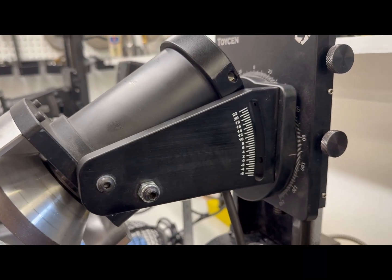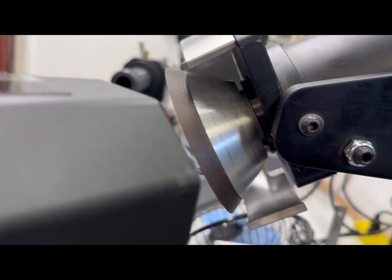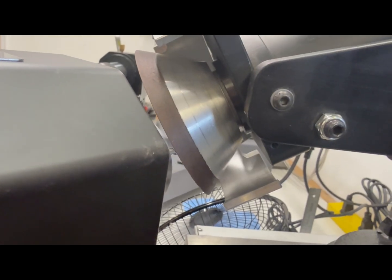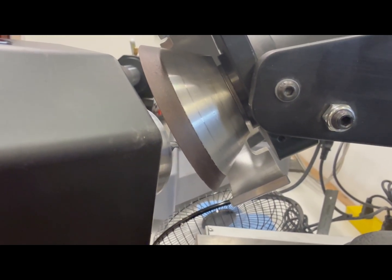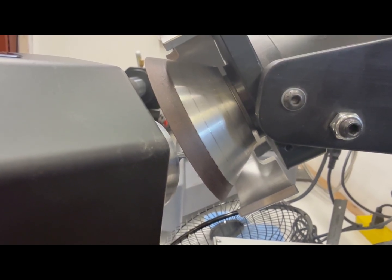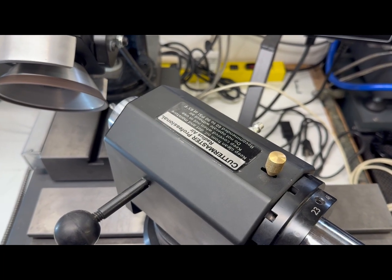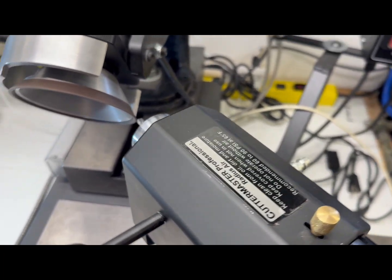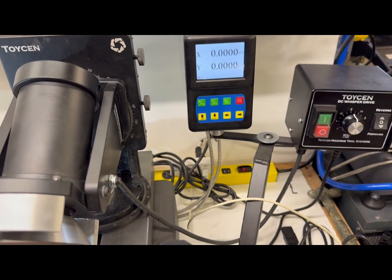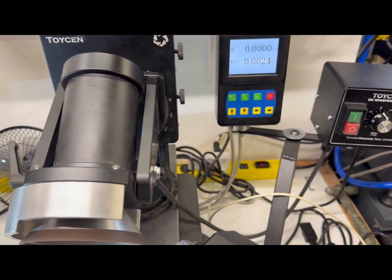Then we remove the tilt lock bolt, put it up where it belongs, and set the motor angle to about the secondary angle. You want the secondary angle to be about twice what the primary is — in this case that's about 40 degrees. Let's grab the secondary. We picked up the angle and we're going to take a couple thou. The secondary in this case is about twice what the primary is.